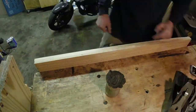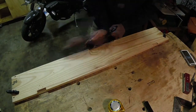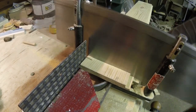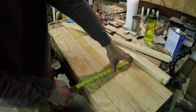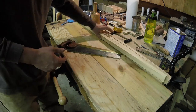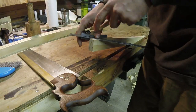What I'm doing here is joining all the boards so I can put them together. They're going to be joined with rabbets — half an inch wide and half the thickness of the board. I'm using my Stanley 78; I actually filmed a separate video on its setup and use. I cut to length with my giant Miller's Falls miter saw — my only miter saw since I sold my electric one. For ripping the length I'm using my band saw, especially with broken ribs, I really can't hand-saw that much.